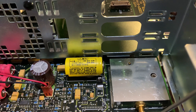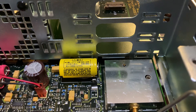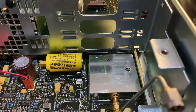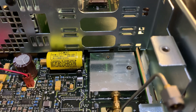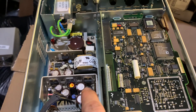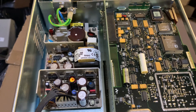If this lithium cell goes bad, it needs to be replaced. If it's an E-4418B, the instrument reverts to behaving as an E-4418A, and the zero calibration number as well as some other configuration information will be lost. I have another video about how to restore those. Back on this side, we have the power supply, which was not made by Agilent — they sourced it from an external vendor, once again for cost efficiency.